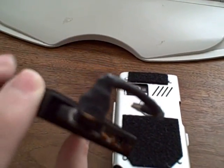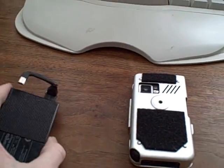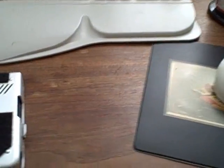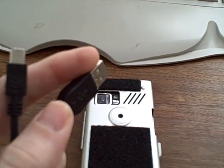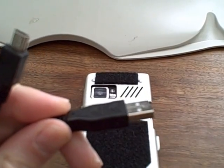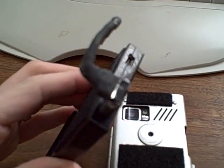The hard part though was this little cable that I made. What I did was I took a standard USB cable — that's the mini USB end, and this here is the regular end — and I simply carved them down with a knife. Inside, these metal pieces can fold off of the wires and you can have access to them. There are only 2 wires that actually power it: they are red and black, and those are the only ones that I used.